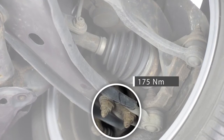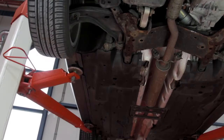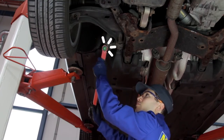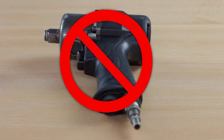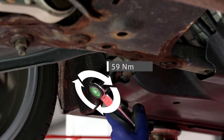This is something we cannot achieve with an air impact wrench. The torque wrench uses a ball detent and spring in the head of the wrench that makes a click as soon as the preset torque is reached. The use of an air impact wrench will not provide this feedback, and the applied torque is indefinite.